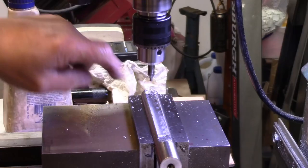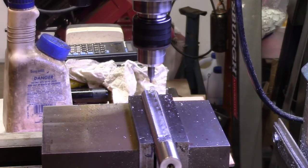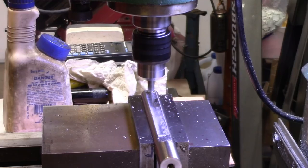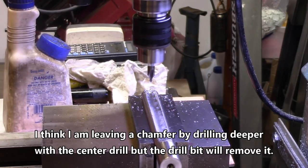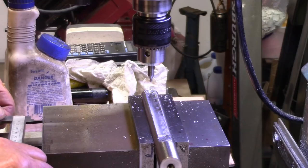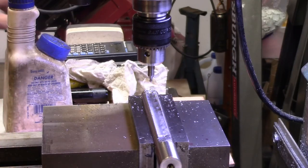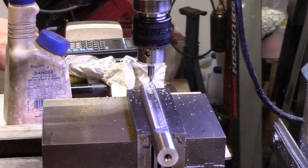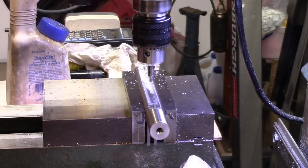These holes are about three point one five inches apart. I know it doesn't have to be laid out perfectly, but let me double check it again — yeah, three point one five inches. So that's what we're going to crank it over to. That's really close, that's it right there. So next hole.